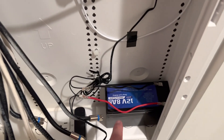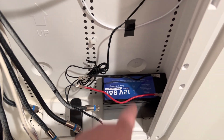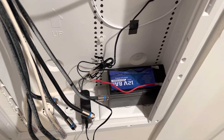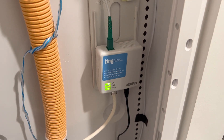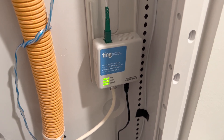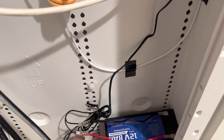So what is wired in is this lithium iron phosphate battery, which is an 8 amp hour battery. It's wired in and has an internal battery management system, so no regulator or anything is needed — it's all self-contained in the battery. So now if the power goes out, the fiber interface has an 8-hour reserve because it draws slightly less than 1 amp at 12 volts. So we are good to go in the event of a power outage.